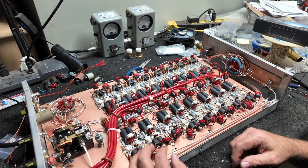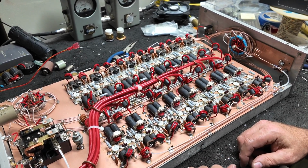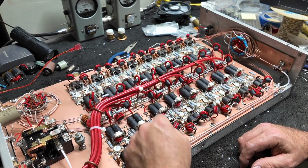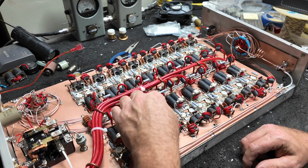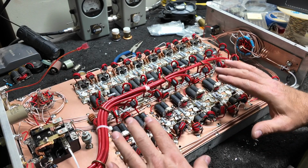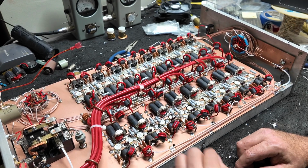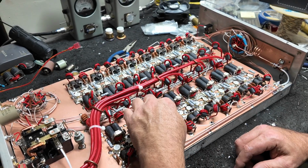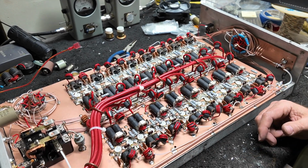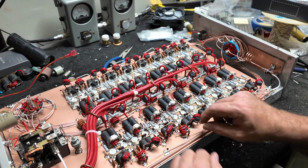We ended up starting by replacing this transformer, replaced this pill. We ended up changing this transformer, this pill strip, this 120, redid everything on this board, ended up pulling this off again, changing that pill strip. That ended up being the problem, this actual pill strip. You couldn't even see what was happening. Even after I changed it, I never really saw it. And we had to change both coaxes too. Yeah, we changed the input and output coax.